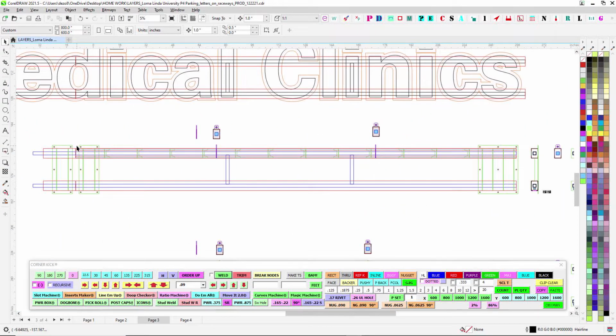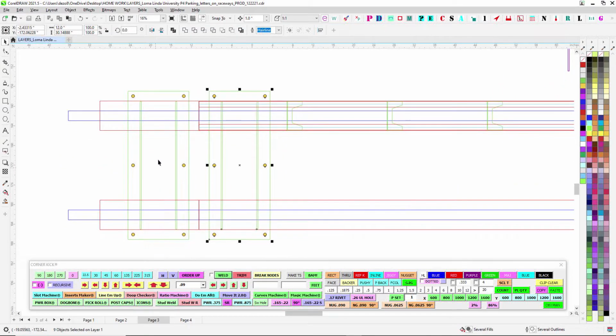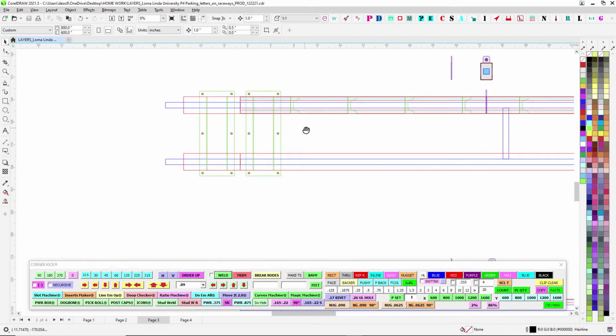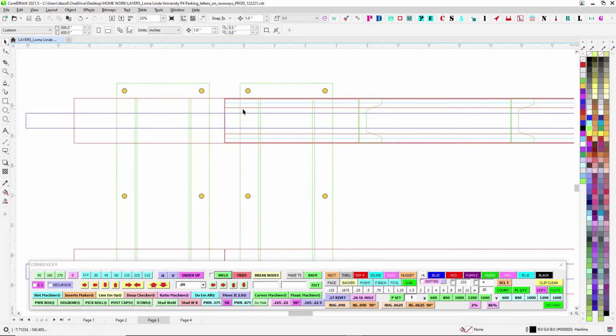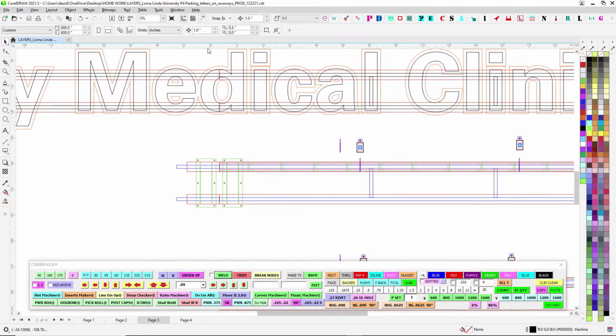And then you just duplicate that on the other side, but it could be smaller because you're going to have this plate and this plate together. Whether or not these actually connect or not, I don't know, jump off that bridge when we get to it. But that way, also you want to keep your bolt holes, I think they like to see more than 4 inches apart. So that's 6 inches there. So we slide this plate over, slide that plate over. So that means we can kind of hide it behind some of the letters, but some of these letters might have to be off and the backer might have to be off for install. The wire can just be hanging out, and then they can access these bolts.